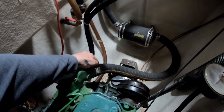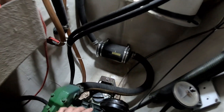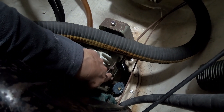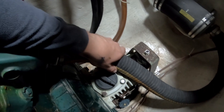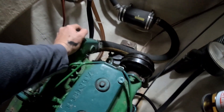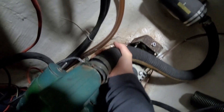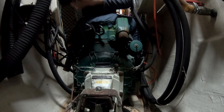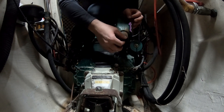I'm going to whip this exhaust hose off. I may have to move these hot water hoses out of the way. I also have to pull the selector cable off. Once that's done we'll come back and look at taking the ring out of the way and tying up the engine so it doesn't fall down. I've undone the hose clips — I'll try and take this off one-handed. It's all nice and rusty, as you'd expect from being in salt water all the time.